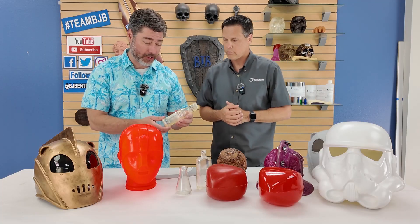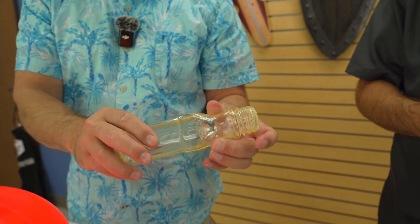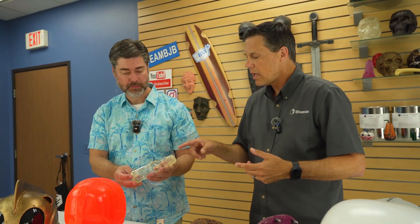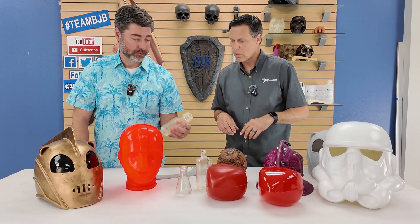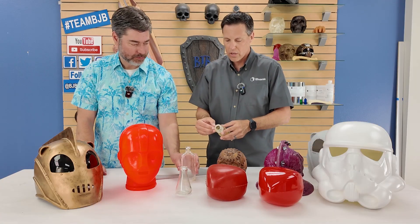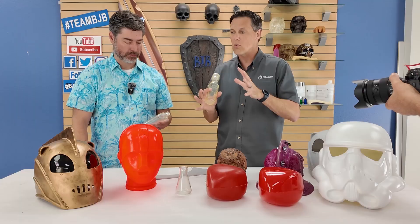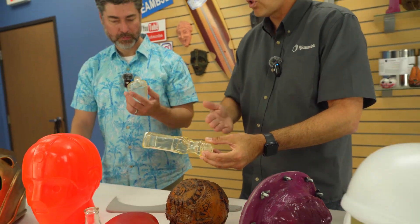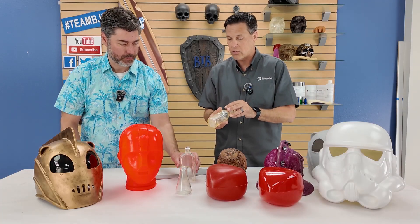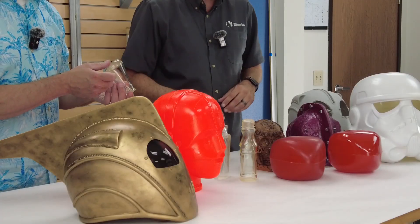These are really nice parts. I'm assuming these were vacuum degassed — you vacuum degassed the casting material before putting it in the machine? A hundred percent, yes. Because the sloshing of the material in there — these are actually some rejects that didn't work so well; the better ones have been taken away by people who never returned them. You can see in some of these you'll catch a bubble here and there. That's where you tweak and tune everything. The material was degassed before, carefully poured in, and we slowed down the machine as much as we could so it would flow without catching disturbances, voids, and bubbles in the geometry of the inside of the mold. It is tricky to do clears — it's possible, but you might have to accept a bubble or two. I've gotten virtually perfect ones, but it can be hit or miss.